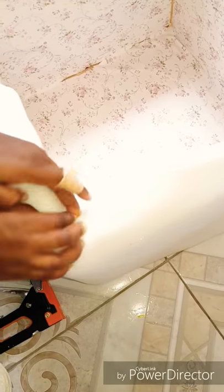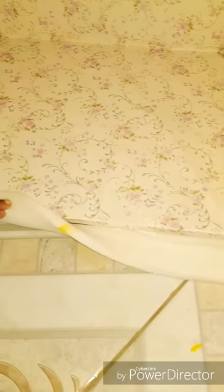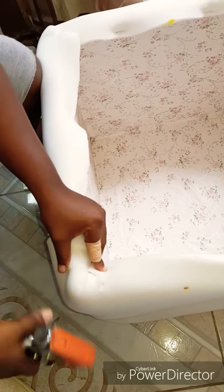All right, use the pleated method again, where you overlap the corner area. Go again, staple, and then lay it down. When you come to the corner, it's imperative that you pull. You will make it overlap. Then I want nothing big and bulgy and ugly. Come again. Bring it and overlap. Bring it down. Pull down this section. Overlap exactly the corner. So, you pull that. I'm going to use the half inch foam sponge and wrap over this so we don't feel the edges of this as we go. Going to complete this.